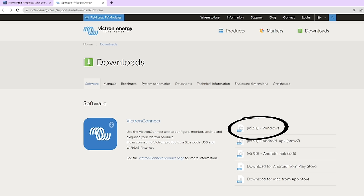Now I need to confirm the rest of the settings for these inverters for managing the current into the batteries and from the mains or generator source, as well as all the charging parameters. For that, we need another free app from the Victron website — the VE Configuration Tools app. We'll go back to the downloads page and scroll down till we get to the VE Configuration Tools. The important thing is you want to have the VE Configure Tools, the Quick Configure Tool, and the System Configurator selected so that you'll have those available to use. When doing multiple units, you need a few more tools.